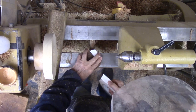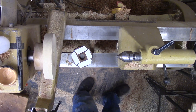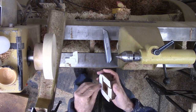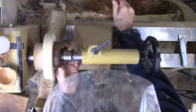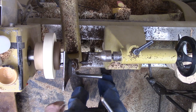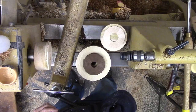Let's take a look at a more difficult case: the heat treated ash. I do not heavily machine stock before segmenting - my process self-corrects for much of the variation. However, since this board had a lot missing from the edge, my segment ring has one side that is too rough to use. I apply double stick tape and press it to a faceplate using a cone center in the middle. Since it can accommodate a cone center, this is quicker than using the Longworth chuck. With the rough side now accessible, my gouge will make quick work of cutting it back to a consistent thickness and face. Normally I would finish with a round nose scraper and a sanding board to achieve a consistent glueable surface, then move the faceplate to the metal lathe and take a couple passes until the surface is near perfect and ready to glue.